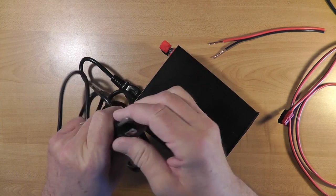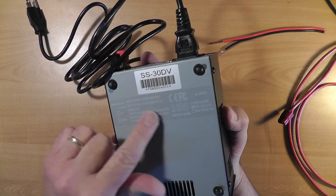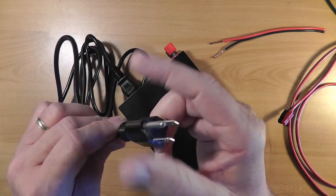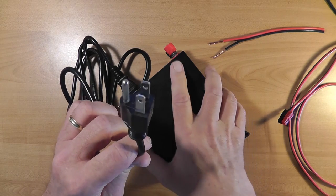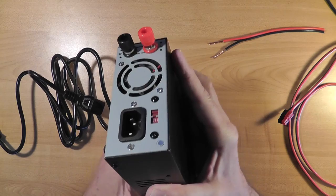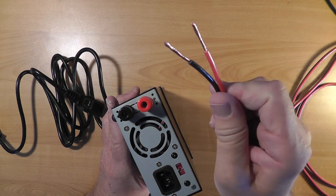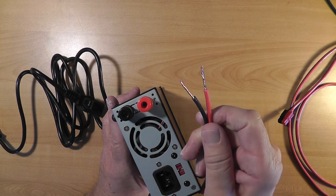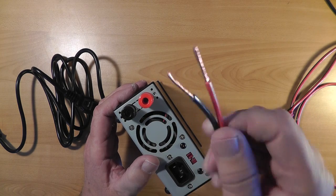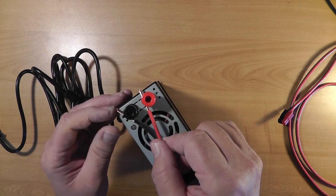By the way, it may say that it peaks at 30 amps output. But even so, that's only 4 or 5 amps in, so you can plug this into pretty much any household outlet. Now, how do we attach the radio to the power supply? These days, all radios come with power cords. Traditionally, the power cords that came with the radio had bare wires that looked about like this. You then wrap these around the binding posts.